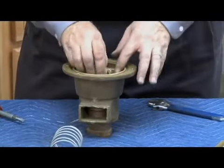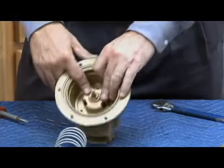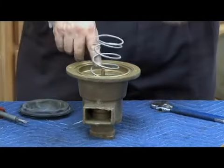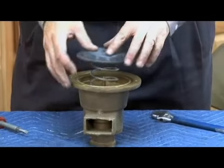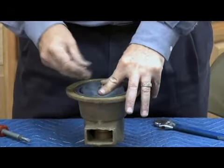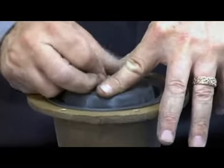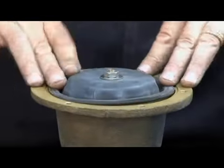Now I need my relief valve guide, which goes over here. Again, 3 screws go in here, hold the 3 screws in the stem. Relief valve spring, my relief valve stem O-ring, my relief valve rolling diaphragm retainer. Now, this is the part that's caused probably the most trouble of this over the years, is getting this nut tight. You can see that we've got a relatively large, meaning about 4-inch diameter rolling diaphragm, and a very, very small 3/8 nut. There's no O-ring assistance on sealing this stem to the top of this diaphragm.